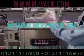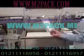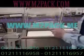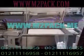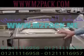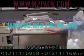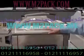I'm going to be vacuum packing packaging peanuts. This gives you a good idea as to how the machine works, and you can see the plastic actually wrap around those peanuts. Now just to let you know what's happening before I actually start this up, I'm going to pull this arm down. Now the air will start sucking out of the chamber immediately. After about 2 to 3 seconds, the pressure of the vacuum inside will actually keep this top held down for me. It's not going to actually suck the air out of the bag, it's going to suck the air out of the entire chamber.